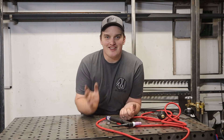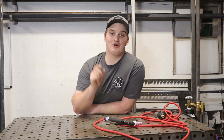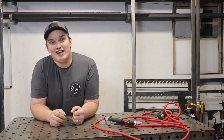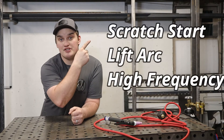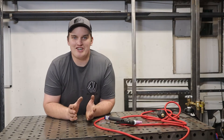Welcome, or welcome back, happy fabricators. In this video we're going to be going over the three different types of TIG welders — showing you how they work, what the differences are, and the pros and cons with each of them. The three different types of TIG welding we're going to be looking at today are scratch start, lift arc, and high frequency.